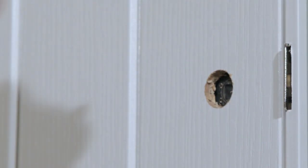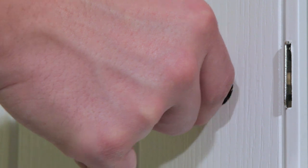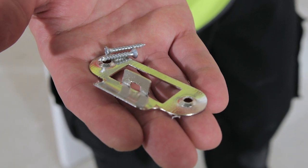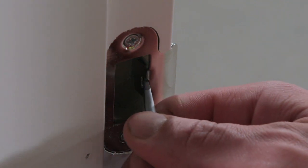When you're happy with the fit and the look of the installation, you can check for rattles. Speedset Plus is supplied with an adjustable keep. Simply use a screwdriver to bend the tang, preventing further rattling.